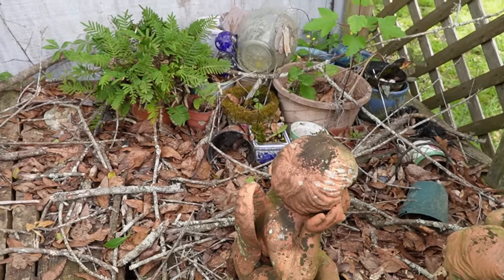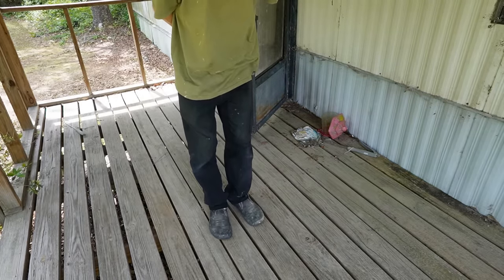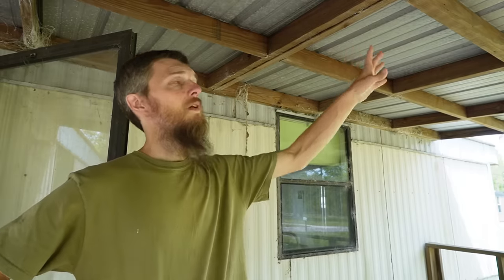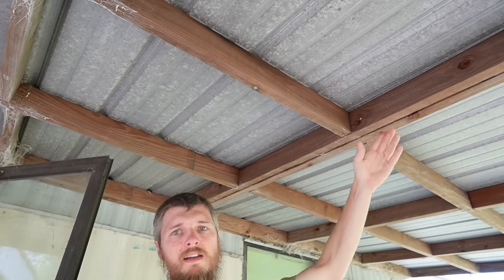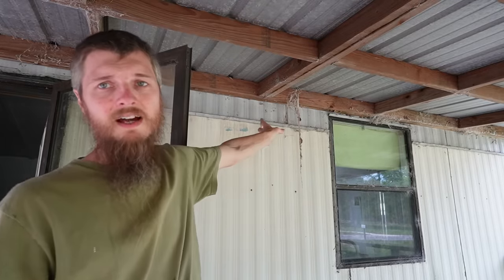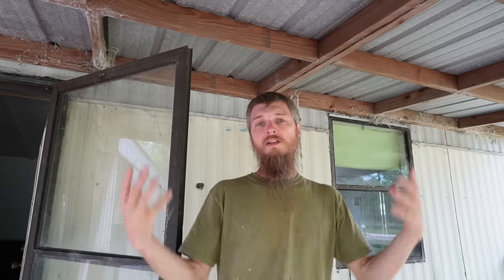There's nothing else to show on the back deck. Here at the front, we have a front covered deck and it's a good size. This is a lot nicer than the back deck — it's solid, but it's not framed right. The whole thing is framed wrong and needs help. The roof is hobbled and cobbled together with no support underneath. Worst of all, it's hooked to the house — don't hook to a mobile home, that's a bad idea. It should be self-supported with its own posts coming down to the ground, not putting strain on the outside wall.